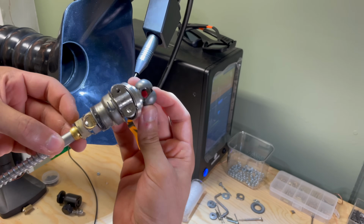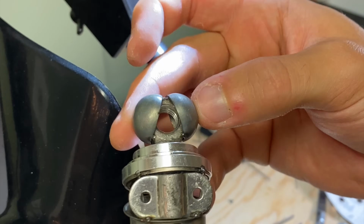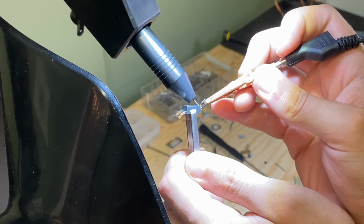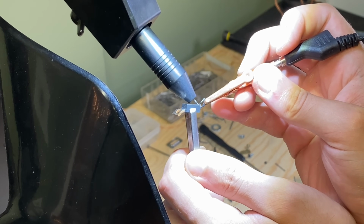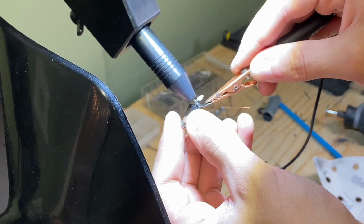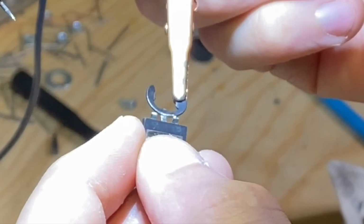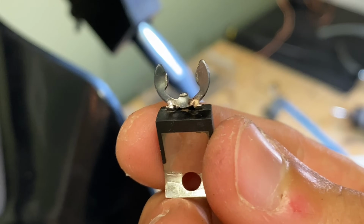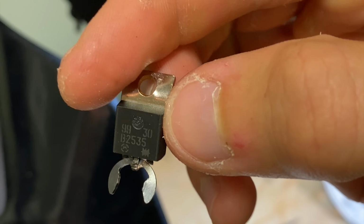At the moment, it wasn't looking very much like a bug, so I found a very bug-like part that would make a good mandible and gently welded it to a circuit board component, making sure not to burn straight through the more delicate metal by reducing the voltage on the welder. Okay, maybe a little bit too gently. After whacking the voltage up, I managed to get the two parts joined nicely.